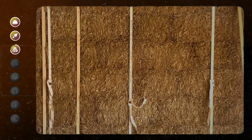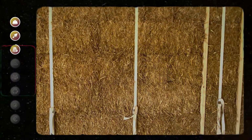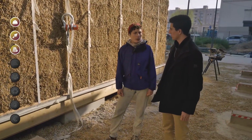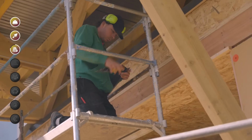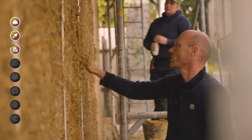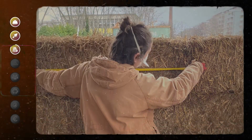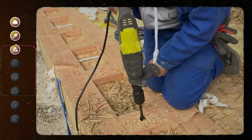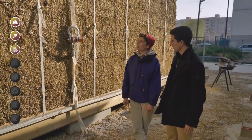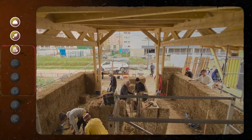And in terms of self-construction, would you say that load-bearing straw is something that is quite accessible, or is it a technique that still requires quite efficient skills? Could I, in self-construction, build my house out of straw, for example? Directly, I don't think so. But if you take a small training course, yes, there is no skill that requires 10 years of practice, 5 years of practice. But on the other hand, there are still things to know, especially about the assembly of the bales. The cleanliness of the assembly is very important. The dressing of the walls is also very important. You really have to be particularly upright because afterwards we come compress it. So to prevent the wall from taking on some shapes, you have to be quite careful with the assembly. That's mainly the difficulty, but once you know how to do it, it becomes easy.